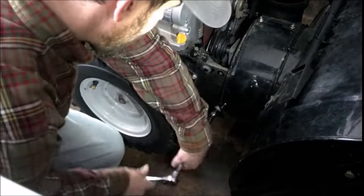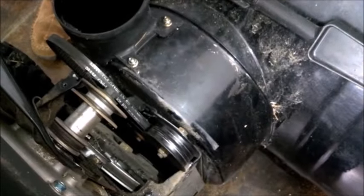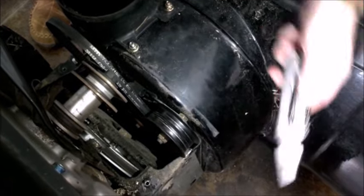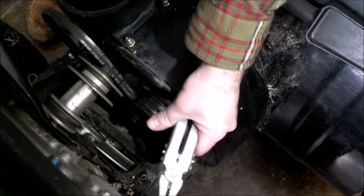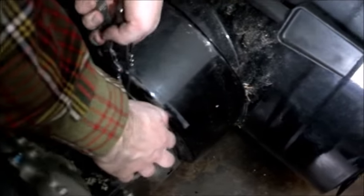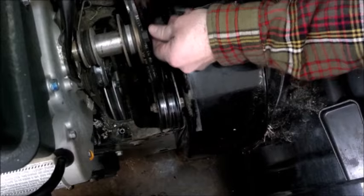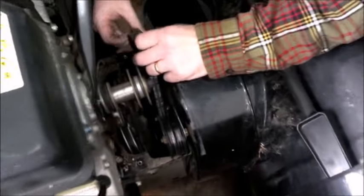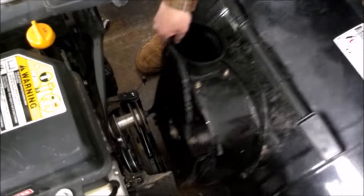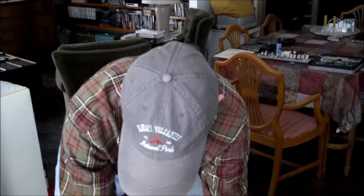Here are the other two bolts on this side, exactly the same spot. It's starting to come apart, but something is hanging it up — I think it's a spring right here. This spring actually controls the brake element. I take my pliers and try to get it out — actually the pliers are overkill, I can do it with my hands alone. That would be the control to allow the auger to run. I'm going to set that off to the side and see if I can get this completely off. Wow, that was nice — that's how you separate it. Easier than I thought it would be.